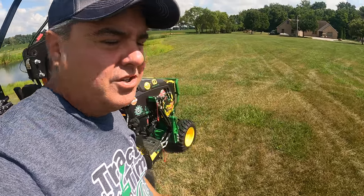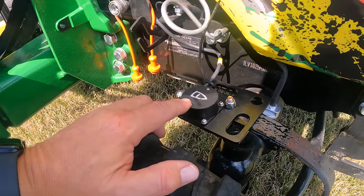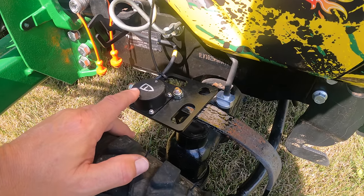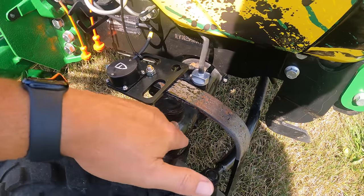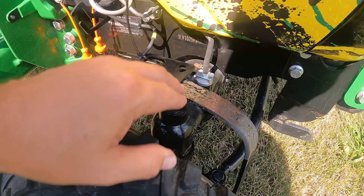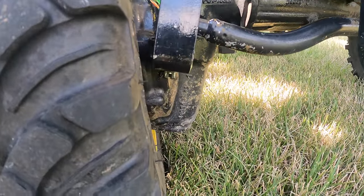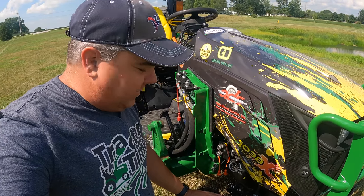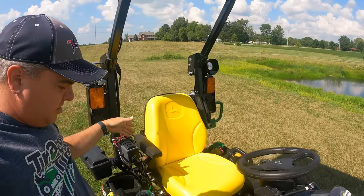Let's look at the other main sensor. This is just a piece of steel I bent to be appropriate — it's an angle sensor right here. This angle sensor keeps track of the angle of the front wheels. There's no calibration; you just put it on and it figures it out over time. It's supposed to be mounted exactly on the hinge point of the front wheels. I didn't have any bolts there, so I hooked it to the tie rod — not the best idea, but for what I'm doing with it, it'll probably be fine.